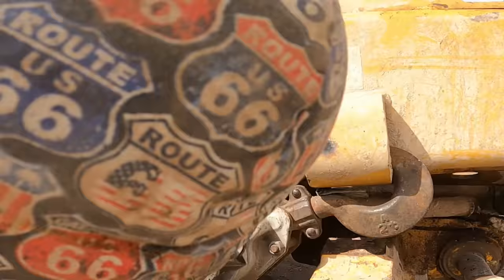This one down here came out all right. So I'll put another pass over that. That was just to seal it up. And I will still run it with a low wire speed so that I can control each pulse, each dime, so to say, right? Anyway, so let me try and reach around this corner.